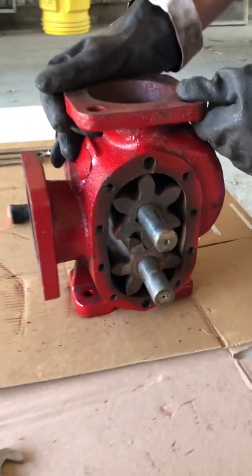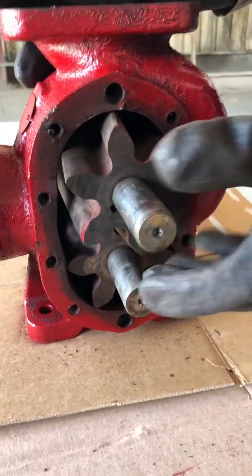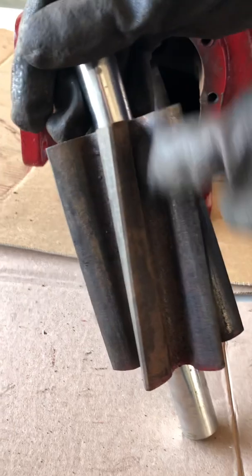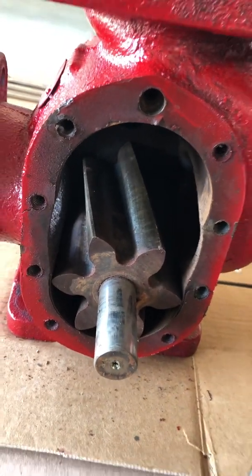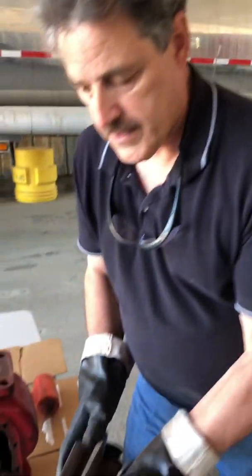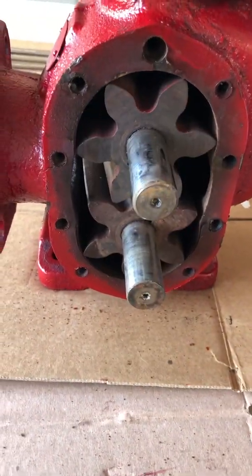When we talk about a gear driven pump, this is what the pump actually looks like on the inside. If you take off the back side, you'll see the gears. I'm going to take one out so you can see it. This is what the gear looks like — you can see where the rust is right in here. When we tell you that you need to turn these pumps over on a regular basis, this is why: the rust will collect and the pump will become impossible to turn. Older drivers will carry a pipe wrench, get on the main shaft where the yoke is, and turn the shaft back and forth to free the pump up. The gear just slides in here and locks into place.